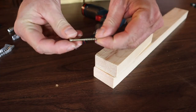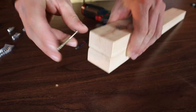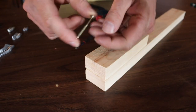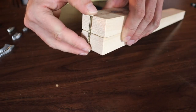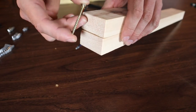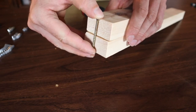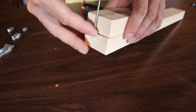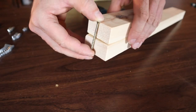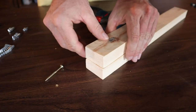The next thing to think about is the screw itself. If you're screwing a thicker piece of wood into another piece, you want a screw that has a decent-sized collar — the shank — that's the part without any threads on it. When you screw into the second piece it allows it to bite into that piece, but it's not just spinning the threads in the first. If you have threads all the way to the top, it can cause the pieces to spread apart.